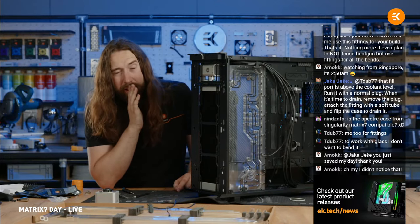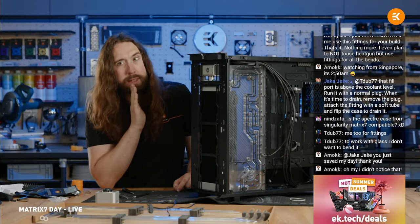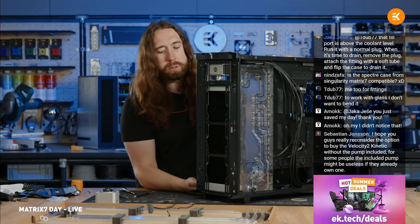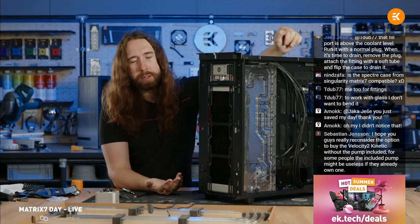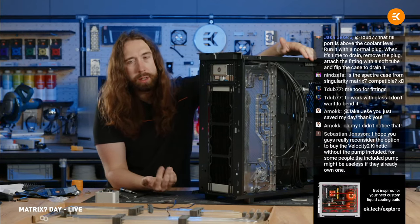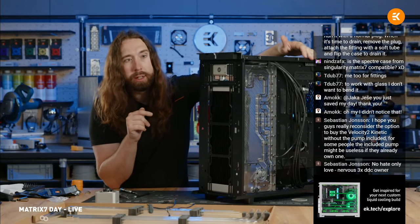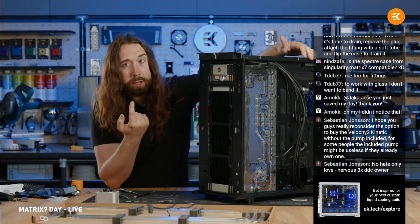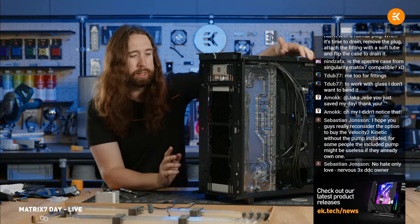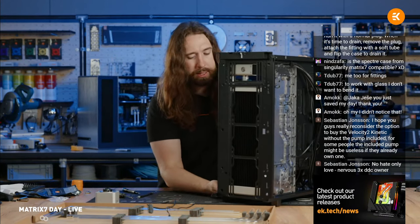I think that the Hero does. The Z690 Hero, I think, is exactly right. Don't quote me, but one of the boards we used when we made the Matrix 7 builds, we had a Z690 Strix E, the Hero, and the Crosshair. The Crosshair needed an offset 3 up, the Strix needed an offset 3 down, and the Hero was just 28mm extended directly to the CPU, as if it had a monoblock. So that was exactly right.